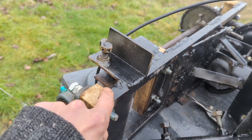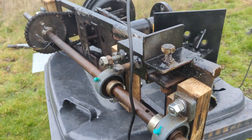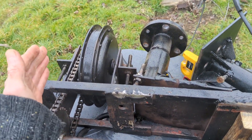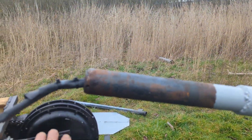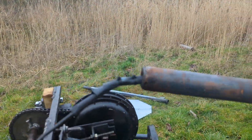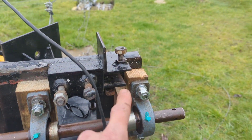The tail — I'll have a similar tail. People ask why it doesn't have a furling tail, and the simple reason is that with an axial flux like a Hugh Piggott one, all of the weight is right at the front. If you had it from the side you'd have all the weight just here and then you'd have your pivot point off the back. They work very well, but I can't see any way of integrating it properly because of the length of the frame.